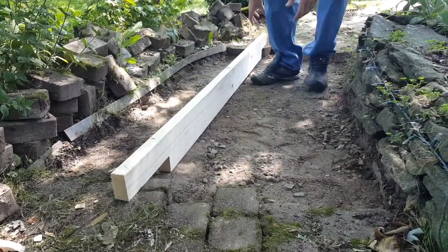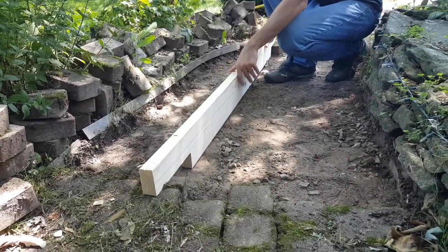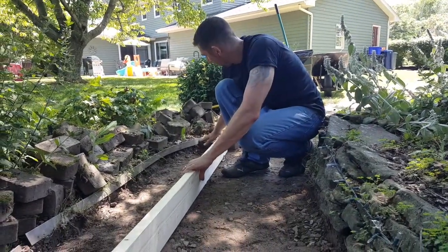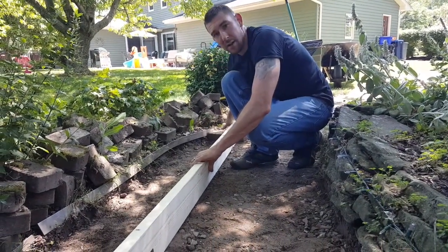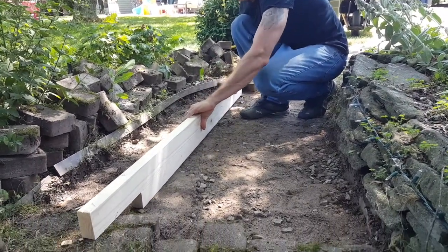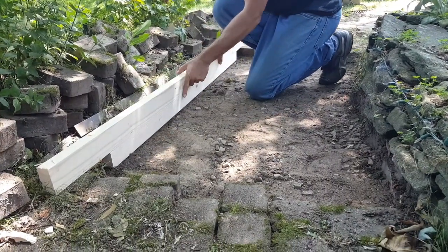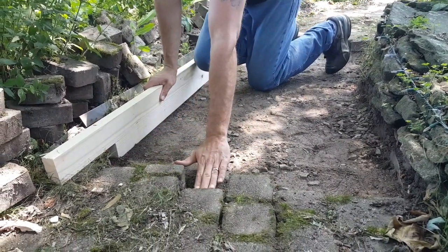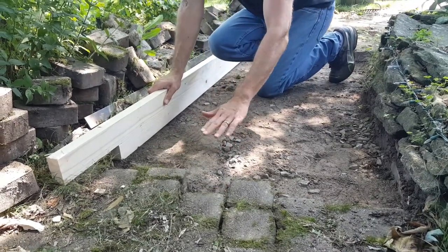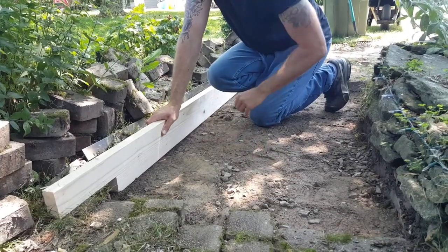As you can see we haven't run into any high spots yet. Now I'm just kind of doing this quickly just for the video's sake, but you want to make sure that the top of these bricks are also cleaned off, otherwise it'll throw off your pitch a bit. So make sure you clean them before we actually put the sand down. This board's great, but it will not get right up against your existing walk, so you're gonna have to do that by hand. You can just get some sand in there and smooth it out with your hand, eye it up, and set your bricks down.